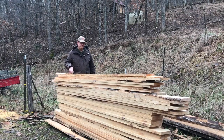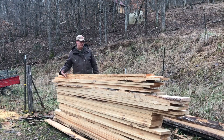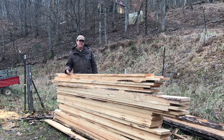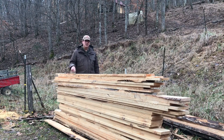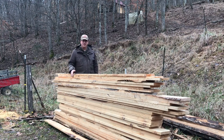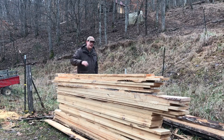Let's take this stack of wood as an example. This is siding to finish out the last corner of our farrowing barn — stuff we milled here. If I was going to a sawyer and saying I need some boards to finish the siding on my barn, the first thing he's going to do is price it based upon board footage, not necessarily the number of boards I need, nor the length or the thickness. Obviously that conversation will be had, but when it came time to actually calculating my bill, he would calculate all the board feet and say: this is what I charge per board foot.